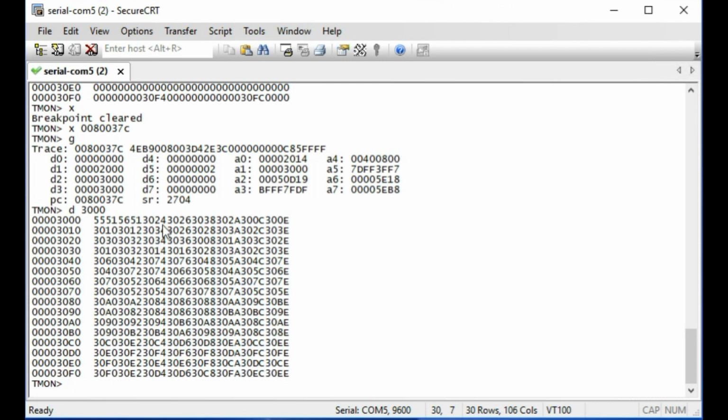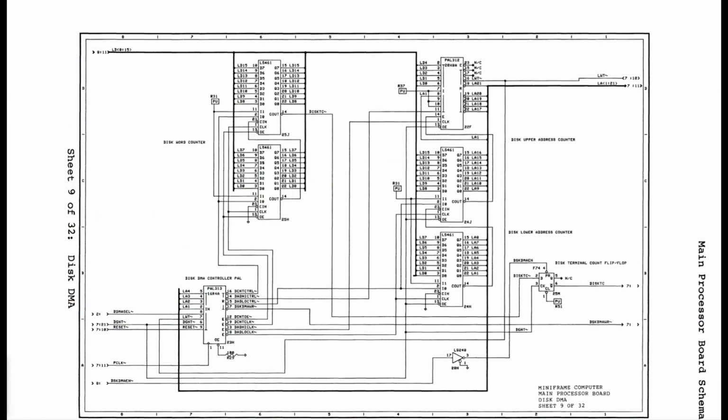So this column here has all fours in it. It's just this next set of 4 bits that is wrong. So it's like there's something wrong with the address register. Given what we know about the data going to the wrong lines in memory, I decided I would start looking at the schematic and identify what was responsible for those address lines.